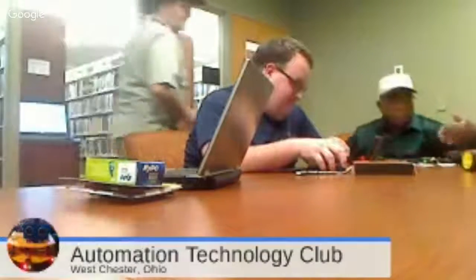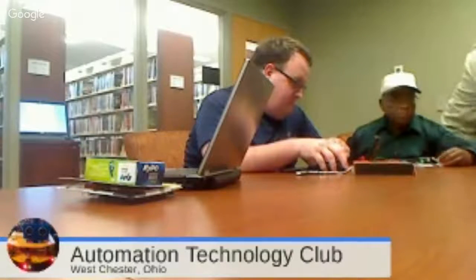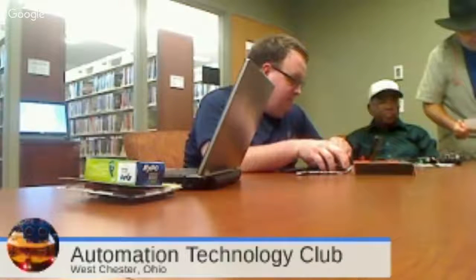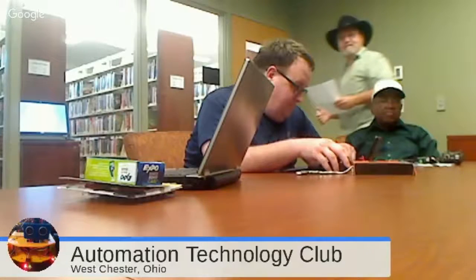Let's look it up right there. There's like 4 or 5 timers in there. The frequency on most pins is approximately 490 hertz. Okay, so actually in the documentation for the library it lists out some of the frequencies for the different things that it'll set out, at least by default. So yeah, it is setting off the different things.